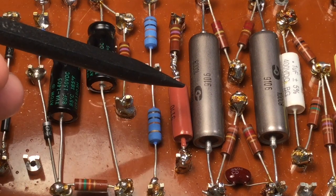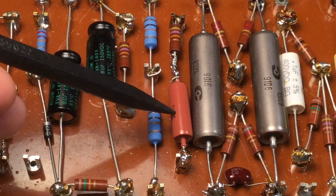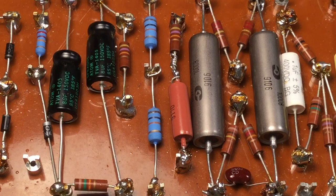For those of you who make this change and hear a little bit of scratchiness when you set your presence, there's nothing wrong — it's supposed to sound like that. Most musicians will set their presence wherever they like and keep it there; it's not like they're always adjusting the presence control like a volume control. We are done. I didn't talk much about the rewiring of the master control and rewiring the preamp control — that's available to anyone working on amplifiers, that data is out there. The amplifier sounds fantastic.